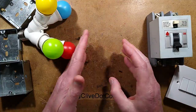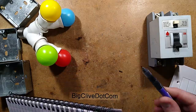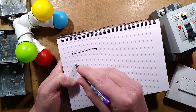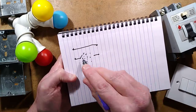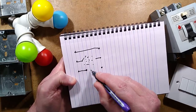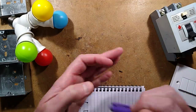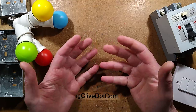When I brought the fuse back to the bench to rewire, I looked at the wire. If you get a bit of fuse wire and it's really short and splattered everywhere, that means it blew with force. But if it's melted and balled up at the ends, it means it failed with over-current. This one had balled up at the end, and that was a really low-load lighting circuit — so a five or six amp fuse shouldn't have done that.